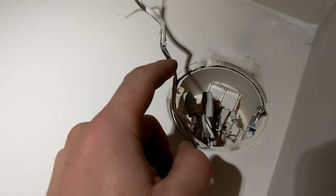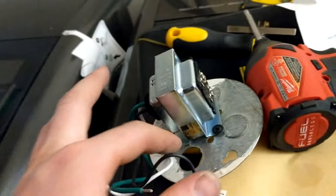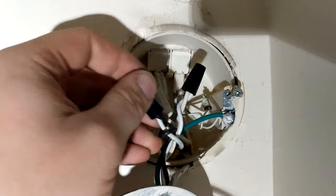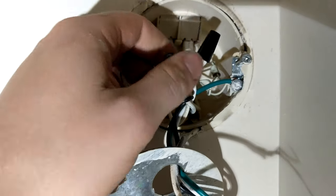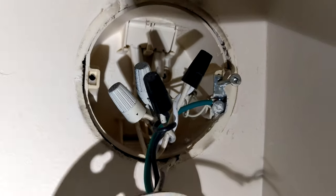Put the ground wire on here and clean it up if it's covered. Black goes to black, white goes to white. Stick the wire out because we'll connect that to the chime. On a two-wire system it's not too crucial, but take a picture and put it in the same orientation as the old one. I had to modify my plate and pop out a proper hole — the beveled hole won't cut the wire whereas the sharp-edged round ones will, so try to put the wire through the bigger hole. Once you get it all connected, do a pull test. When tightening, you should see them twist around each other — three to seven turns is good.